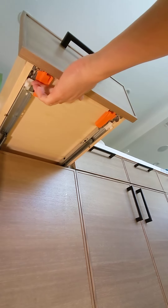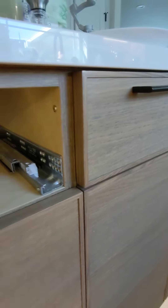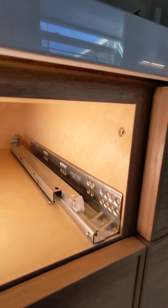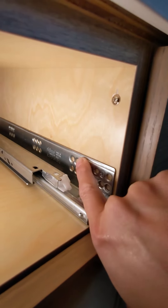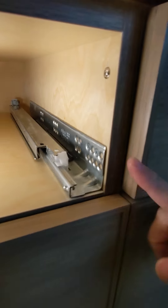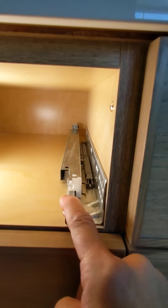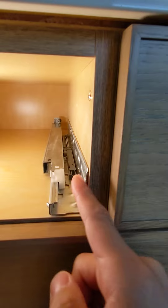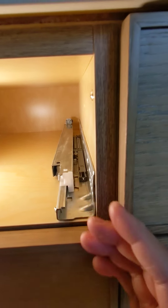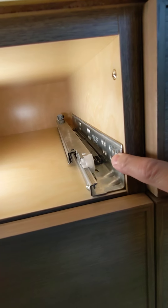Once you have it opened, you can see that you have screws here. Make sure they're tight so your drawer glides shouldn't be sticking out. Sometimes when they're loose, all that weight can pull the screw away from the wood, and what happens is if you even have like a sixteenth or an eighth of an inch that's not touching the side of the cabinet, the glides will start rubbing against your drawer box.